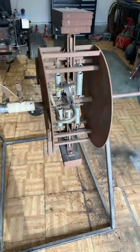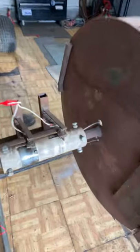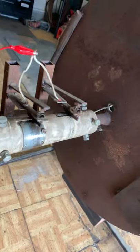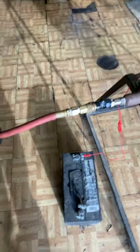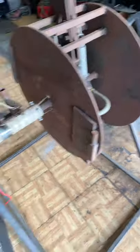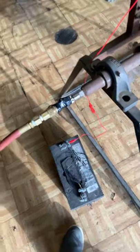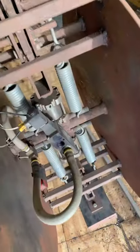Right here is the basic machine. You have a single shaft through the center. I have a contact cam style for my power and it is run by compressed air. This is currently hooked up to my air compressor, not powering itself — just using the compressor for demonstration purposes. This is a hollow shaft; air goes in to the middle and I have an outlet there that supplies both air cylinders.